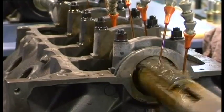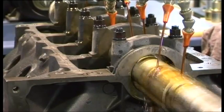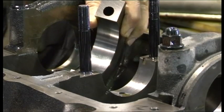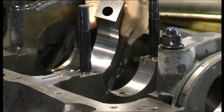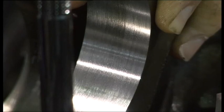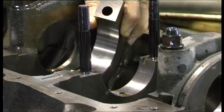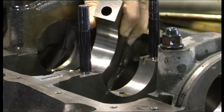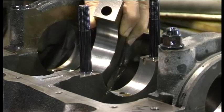That's absolutely critical to any engine and it's the basis of every other machine work process we undertake. He's finished the process of honing to size. He's removed one of the main bearing caps so we can see the surface finish. You can see it's got a crosshatch — it looks like a cylinder block bore that's been honed. That surface finish is also extremely important: it increases the surface area of the metal, holds the bearing in place more tightly, and helps in dissipating heat into the coolant.